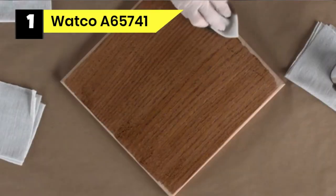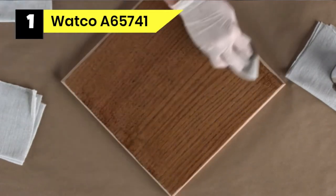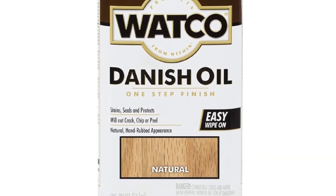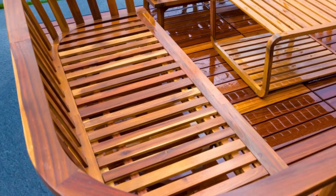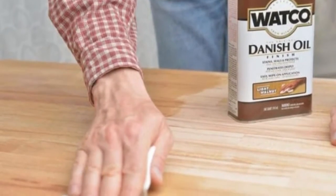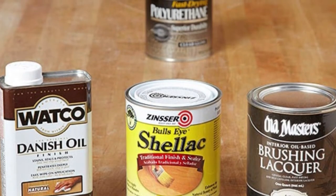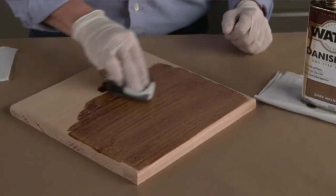This product is easy to work with and dries reasonably fast. Applying two or three coats leaves your benchtop looking new and protected. It is more suitable for indoor furniture. The finish is easy to use and cleans effortlessly with soap and water. You can use it in the kitchen workbench as the finish is pet and food-safe when dry. Work in a well-ventilated space as it produces strong fumes when used. This finish keeps your wood from drying out. For a beautiful finish, wipe the excess off after 15 minutes.